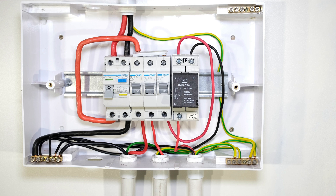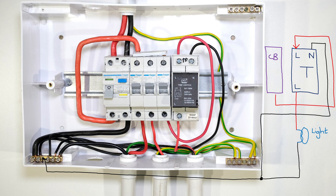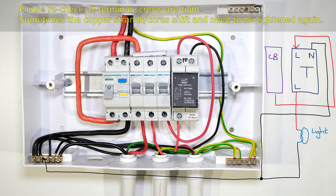In summary: from the output of the circuit breaker, you go into the timer. From the output of the timer, you go to your load — in this case a light. The neutral wire of the load is still connected at the neutral bus bar, and you add an additional neutral to your timer into that same bus bar. That is how you wire the CBI timer into your din rail DB board. Thanks for watching.